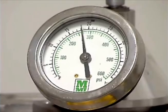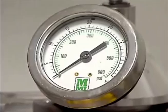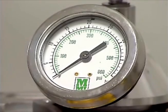At the first visual indication of main pipe melt at the curved center of the heating tool face on the main — that is, the crown of the main — reduce the heat-up force to heating soak force. Continue timing as needed.